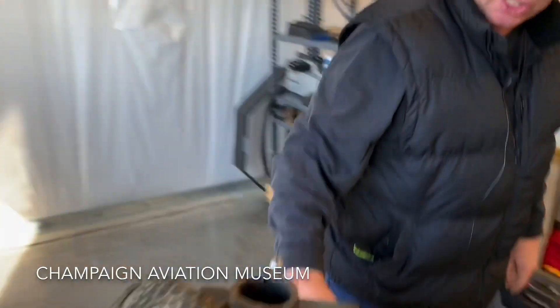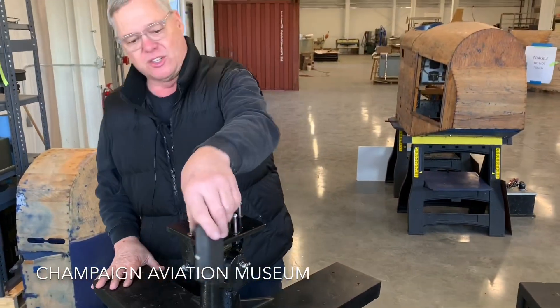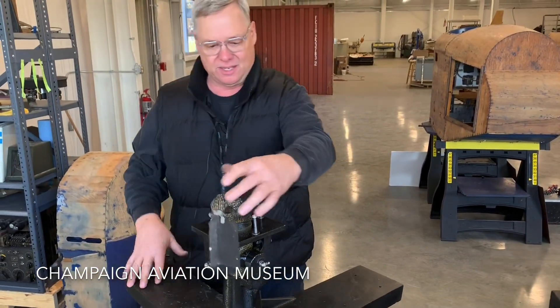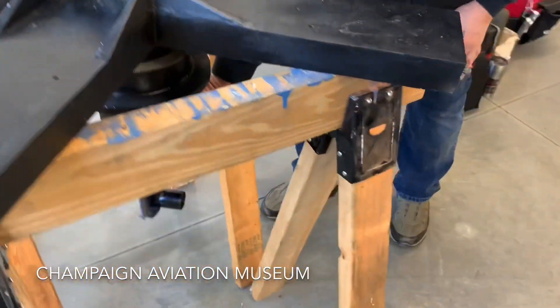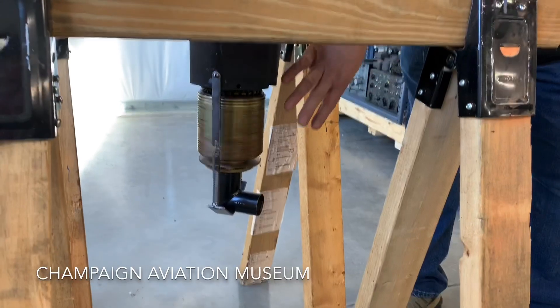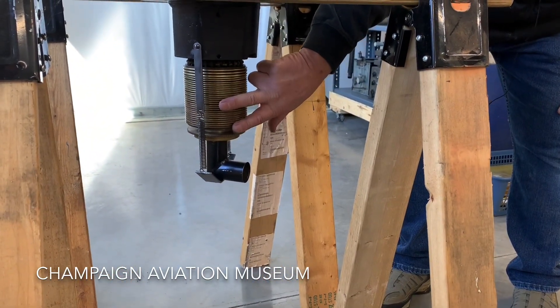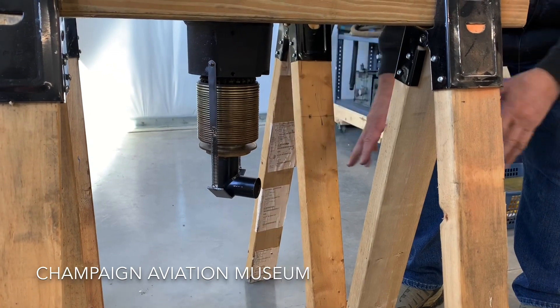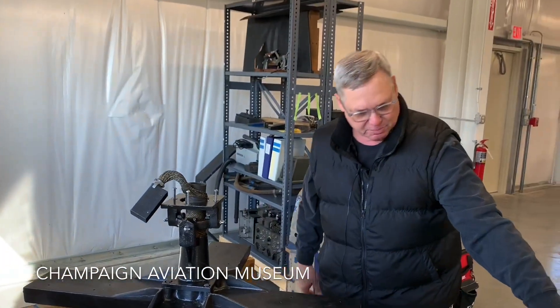This is the pedestal part of the motion system, so this would plug into the cockpit. It's fed down to these slip rings down below. The slip rings are set up so that they'll have brushes that will ride on the slip rings and feed the signal to components down below in the base. This is the base.